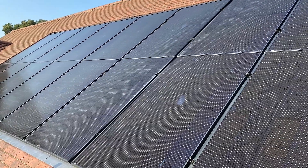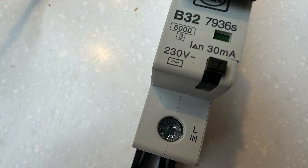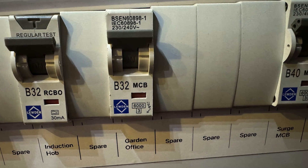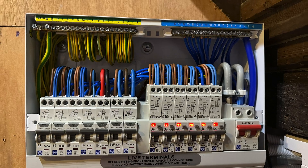Renewables. In the coming months, the property will undergo the installation of solar PV and battery storage, and the circuit supplying a remote building where that's going to be fitted has several issues. Currently it's connected to a type AC RCBO, which fails to address the DC leakage problem. Also, we have RCBOs protecting that circuit which can only detect earth leakage faults when power flows in one direction from the supply to the load. This poses a challenge with solar and battery storage systems where the power can flow in the reverse direction, potentially rendering the device ineffective. To resolve this, we plan to switch the remote building to a circuit protected solely by an MCB, and fortunately the cable installation method allows us to make this change seamlessly.